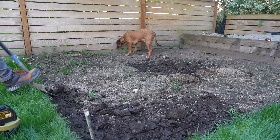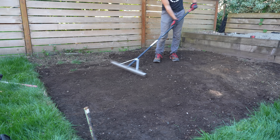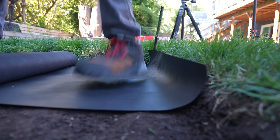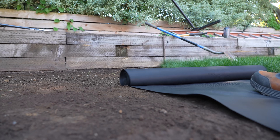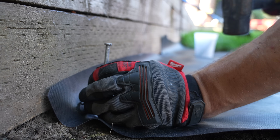In order to do so, I grab my laser level and determine where the high spots and low spots are. Once the ground is smoothed out and level-ish, I can get to a weed barrier. You do want to apply some type of barrier between the soil and the crushed rock being brought in afterwards.